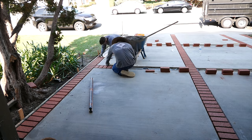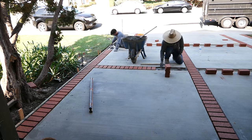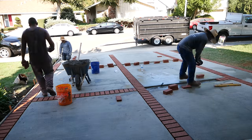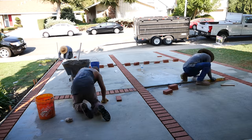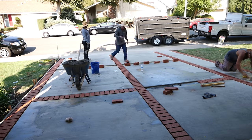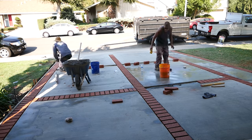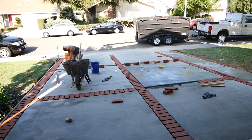Cracking is one thing, but when you've got massive separation or settlement, that's a different thing — one is structural and one is just visual. When you're running your spacing, what you want to do to utilize all full bricks is just change your spacing a little bit. That way you have all full bricks and the grout joint will be very minimal — not really noticeable — but you can still use full bricks just by adjusting the spacing.